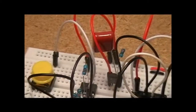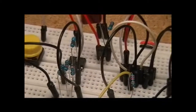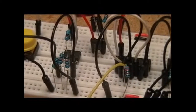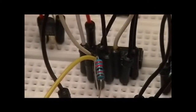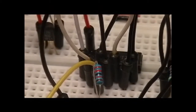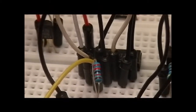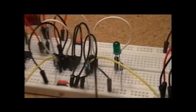And then next to it I've got a BJT, and the two are connected with a capacitor, in this case a decoupling capacitor. And the output from that transistor goes into a CD4013 dual D-type flip-flop, which is basically doing the toggling, and then the output from that goes into the SCR right in there, and then finally the LED.